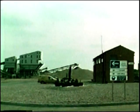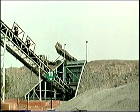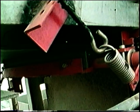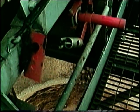Several types of Hoverdale scrapers are in use at ARC Shardlow in the Trent Valley on sand and gravel aggregates. A C-type is fitted to the primary feed conveyor, handling raw as-dug material. The scraping portion of the blade gives maximum pressure to the centre and is self-adjusting. The C-type gives excellent performance and wearing qualities and is capable of operating up to 3 years maintenance-free. The cleanliness of the belt shows the efficiency of the cleaner's performance.